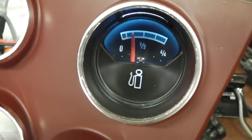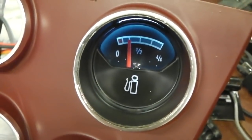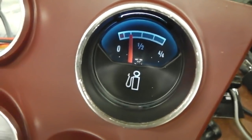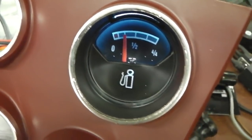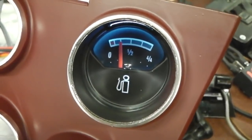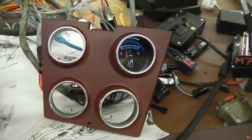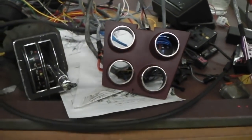See you in a sec. Just a little thought on the conical lens we talked about. I wonder if they added it halfway through, when customers complained you couldn't read the gauge, because the conical does act as a magnifier. I'm wondering if the first ever ones were totally flat lenses, and then someone said I can't read them gauges, so they thought we're knackered now, we've built the pods, so they fitted these conical ones to try and magnify it perhaps. Just a little thought before I close. Mind's always going. Inquisitive minds. See you in a sec.